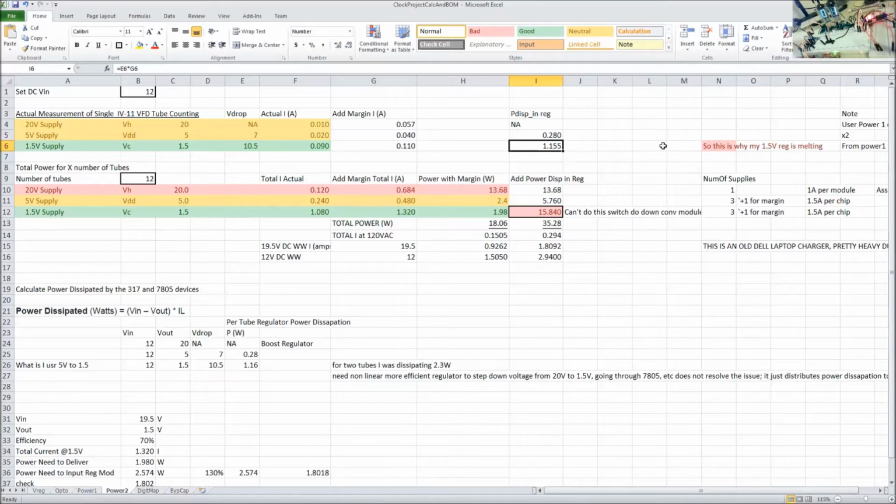Now, if you notice on the screen there, it's dimming, and I bet that voltage is dropping again. It's dropping because, in spite of the fact that I put that piece on there to try to do a heat sink, it's still probably thermal throttling at this point. Now the question is why.